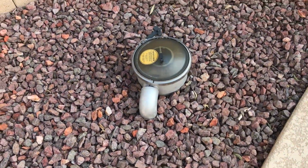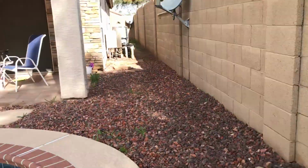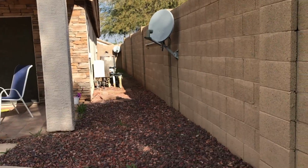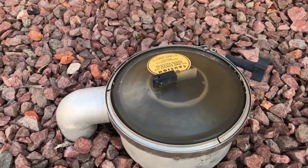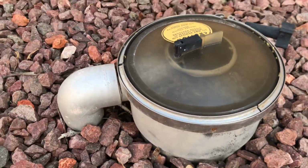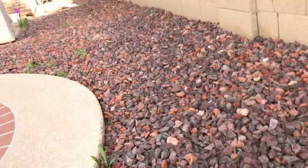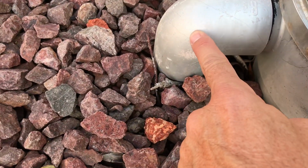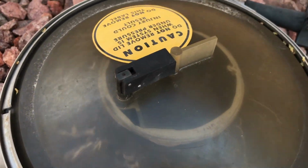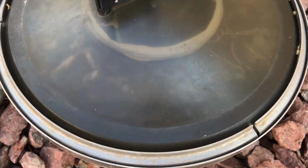Okay, so I wanted to show you an example of this type of actuator. Obviously, you notice the pump and everything, and the equipment is all over there. And this actuator is near the pool itself. So if you notice, this one again, it's gray. This is again a low profile one, but this is an example of a side feed. So the water is going from the returns over there from the pump and the filter through this into the side, and that turns this paddle wheel up here. You can see that, and then that in turn turns the gears.